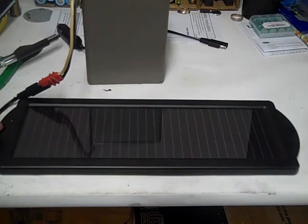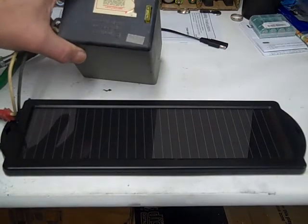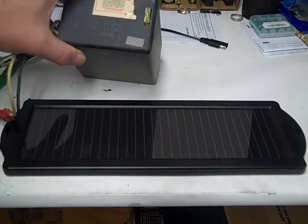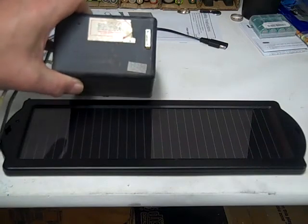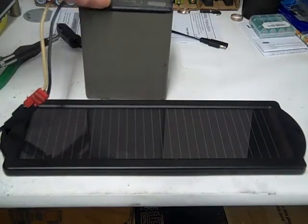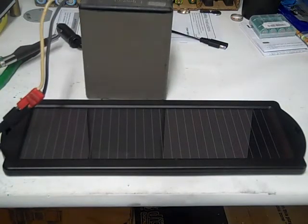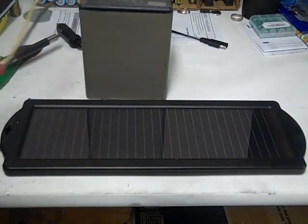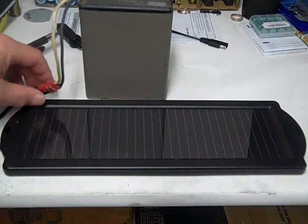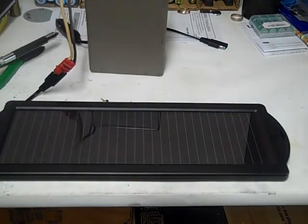I got this battery charger and found a 6.6V, 9.5Ah L Power battery. It's used to power one of those electric cars for kids. It's been down in my basement for about 15 years. I put a meter on it and it's showing 0.2 volts. I put a new fuse in it and just plugged it into the solar charger down in the basement — we were getting 14 volts with that light. We're going to leave this here for about a half hour and see if we get any response from the battery.